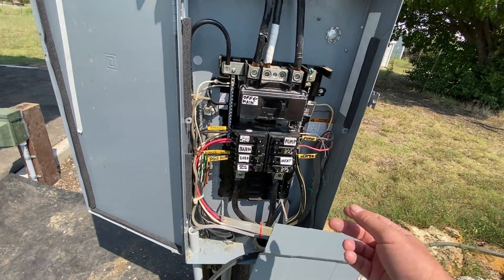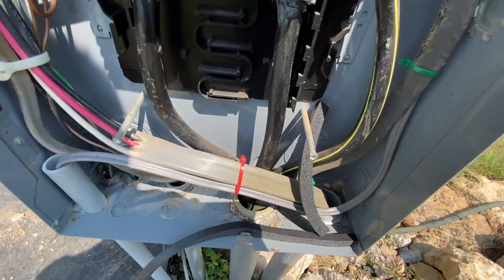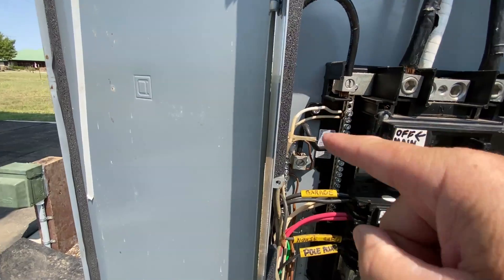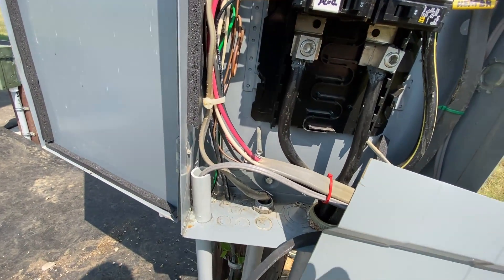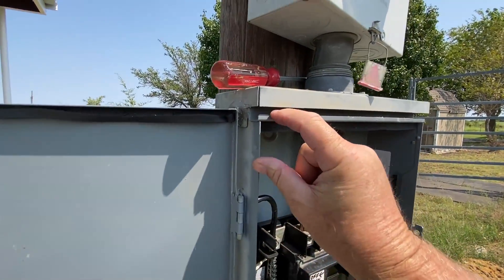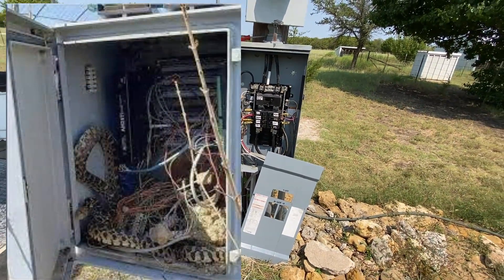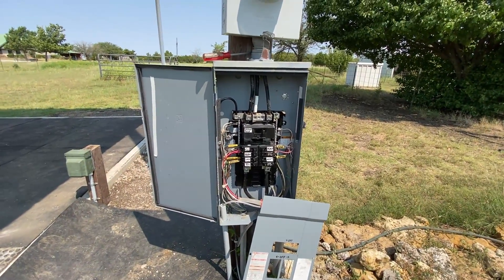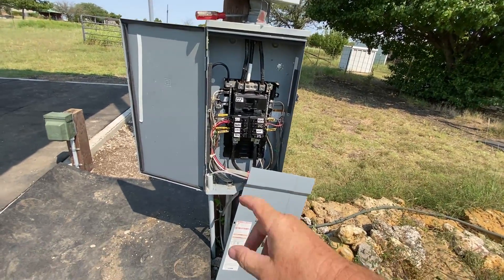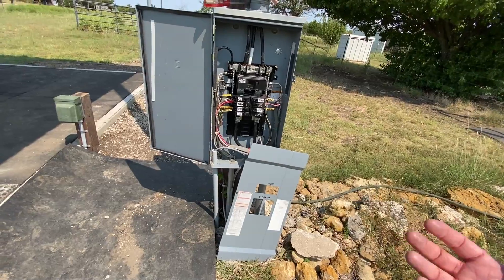If you ever go outside and pull open your box, it usually looks like shit. I would come and clean it, and every time I go in here I'm like, this thing's filthy. There was a lot of little holes down here that weren't clogged up, which I clogged up now. So now there shouldn't be any holes down here that they'd get in. I clogged up all these little filler holes. Now there's caulk on those screws. I'm using regular silicone. So now all those are closed, and I put this weatherstripping here, which really makes a great seal. This is where most of the bugs were getting in, so hopefully that will keep my outdoor fuse box looking clean. Ants and spiders really like to build their nests in these things. A lot of people will pour ant killer at the bottom, but the ant killer dries out and doesn't work. So that's kind of a temporary fix.